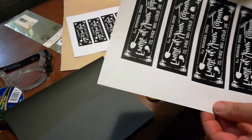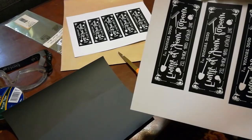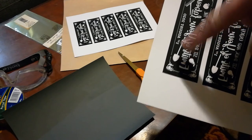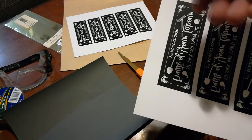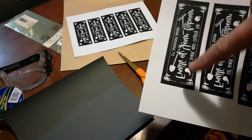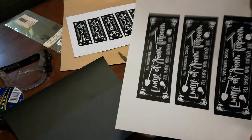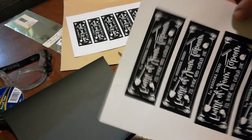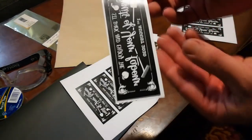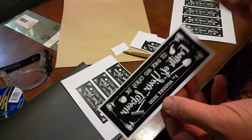So I made this little design. This is what's called a resist, which will go on top of the brass. I will acid etch the brass and it will eat away at the white parts. The black will remain on the brass, preventing it from being eaten away by the acid. So we'll have these little engravings where the white parts are, and then I'll spray paint inside and sand the top so only the engravings are filled with black. Right now it's inverted so you probably can't read it — I won't reveal it now, wait till it's done. I won't go into detail; there's plenty of tutorials on YouTube about how to do this. Basically I'm going to heat this onto some brass.